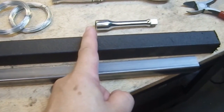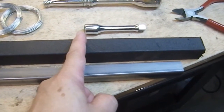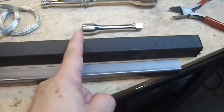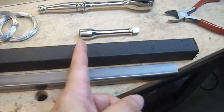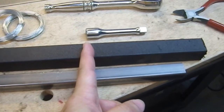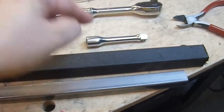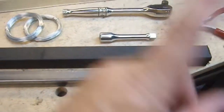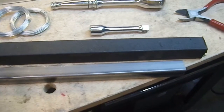I'm going to cut this section out so you just have two walls and a hole going through. He designed this so that his tightening device was a steel rod or iron rod bent at a 90-degree angle — just a 90-degree crank. There's a slot and the short end goes through the tubing. You put the wire in there, you turn the big crank, and that tightens the wire. Beautiful idea.